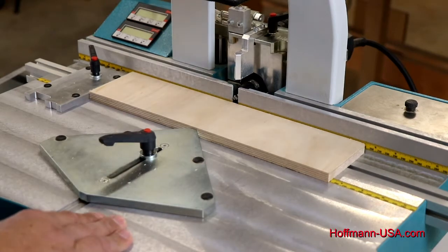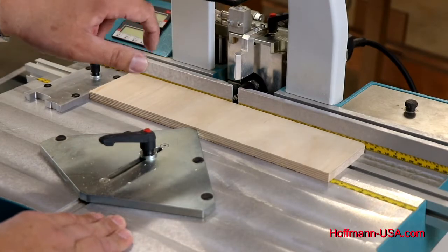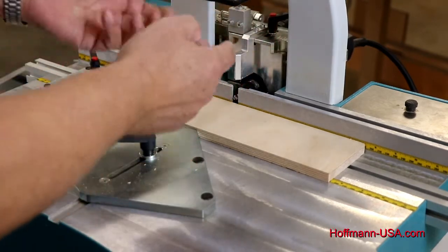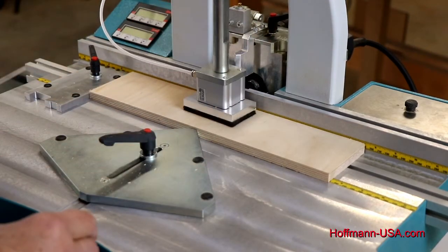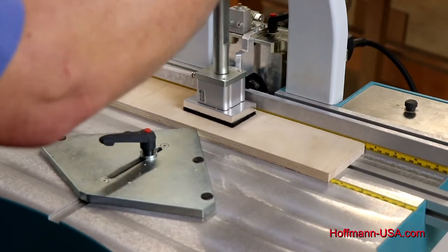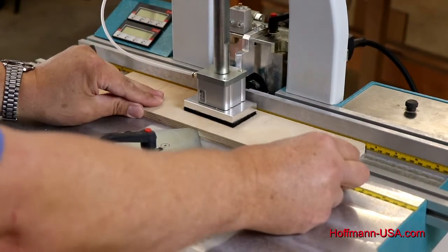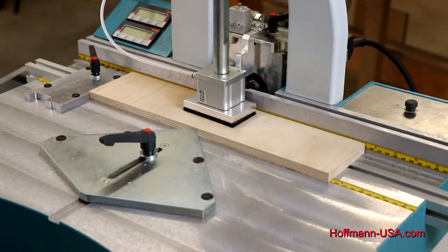As a last step, because we're not using compressed air when cutting the chip breaker — we're doing it by hand — I don't have any air pressure on the hold-down clamp. But it has this foam pad on the bottom, so I will lower it down and then push down on top while I tighten the hold-down stand, so now my scrap piece is securely held in place.